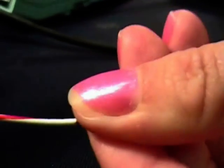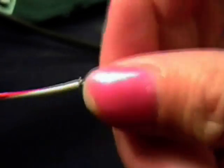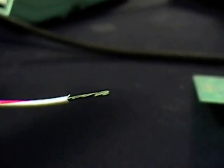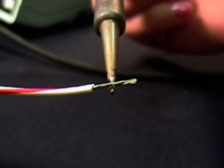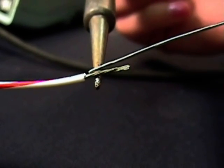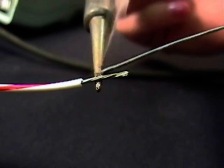You can use solder to do other things besides soldering components. Solder is also used for tinning wires. This is useful if you have loose wires and you need to connect them. First, twist the wires. Place the iron under the wire and melt the solder from the top. This allows the solder to bind the small wires together.